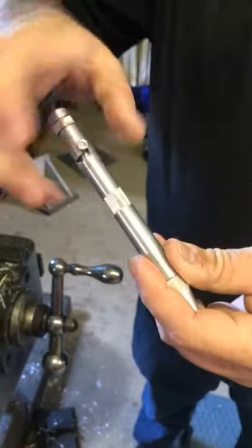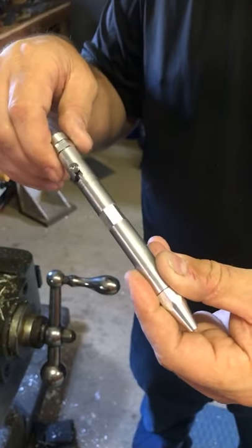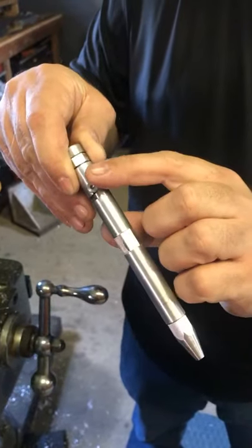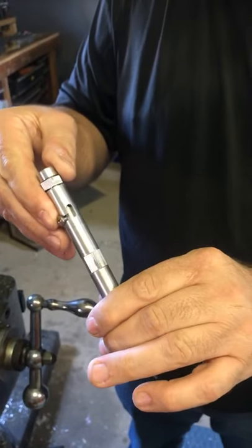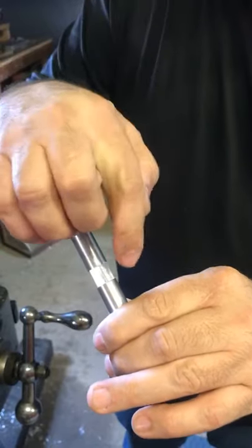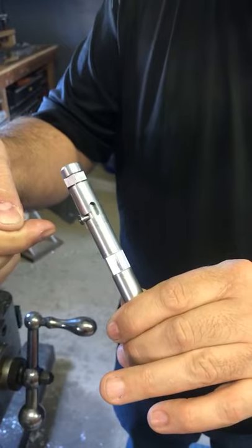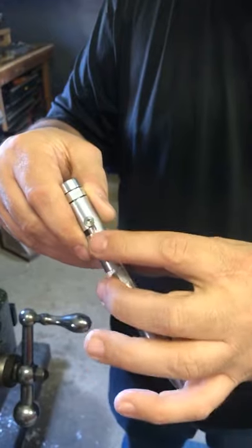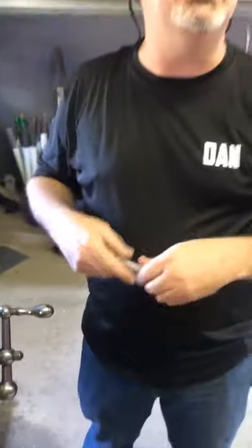No one makes a transmission for the twist mechanism to make the ink cartridge eject and come back in — made in America. So I designed 100% by myself a bolt-action mechanism that will let the ink cartridge come in and out. You see how that works? That's a slot that goes down, across, and then has a little indentation to lock the bolt in place while you're using the pen. A spring retracts it back up.